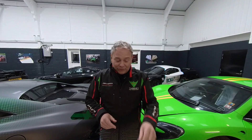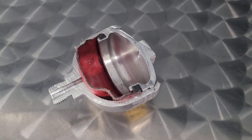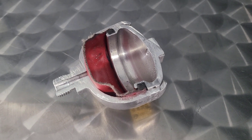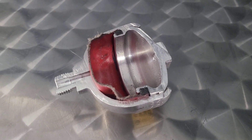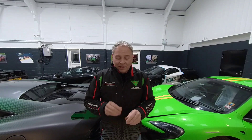They're very simple things, as you can see, because we decided to cut one open. All they are inside is a metal casing with a rubber or rubberized leather diaphragm inside. It's that diaphragm which changes in terms of the pressure of the fluid inside. The downside is that these are also full of nitrogen, up to 7.5 bar — so that's quite a lot of pressure.